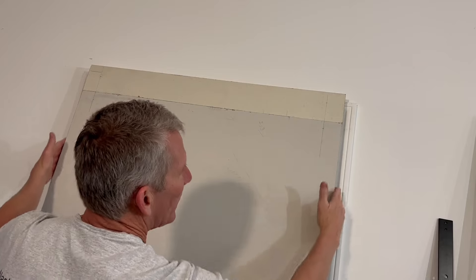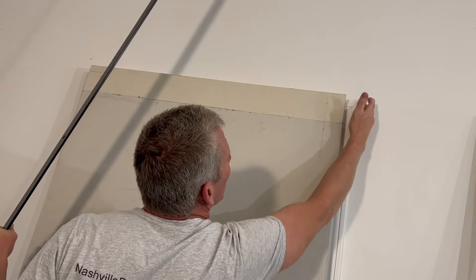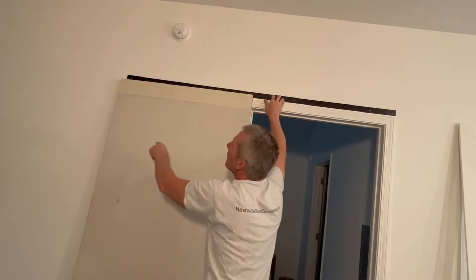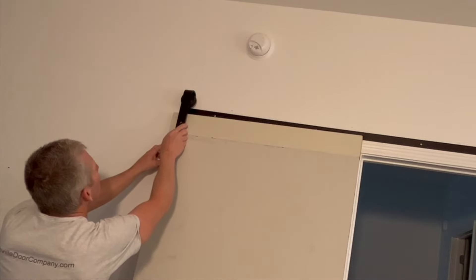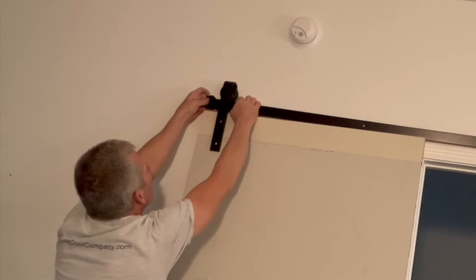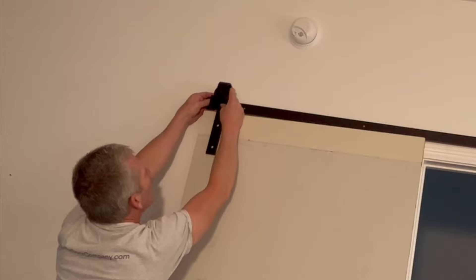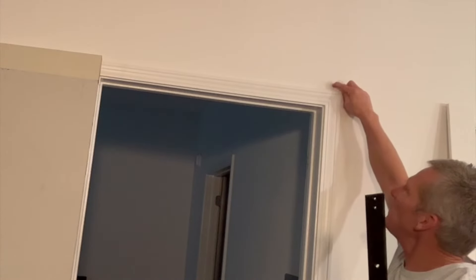When our door is centered over the doorway, we don't need the track right at the edge of the door. We'll just line up the edge of the track with the edge of our casing. With the door in the open position, let's put the track up there and make sure we have enough room. The track doesn't quite go all the way to the end of the door — it just has to go to the wheel. We can cheat the track over an inch to get the bumper on the end, or better yet, bring the wheels in more so the edge of the hanger lines up with that mark. We'll put this track just a half inch in from the edge of the casing.